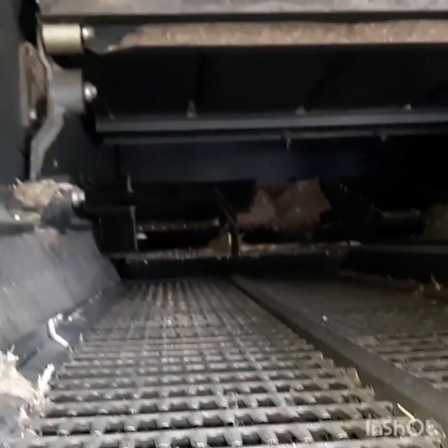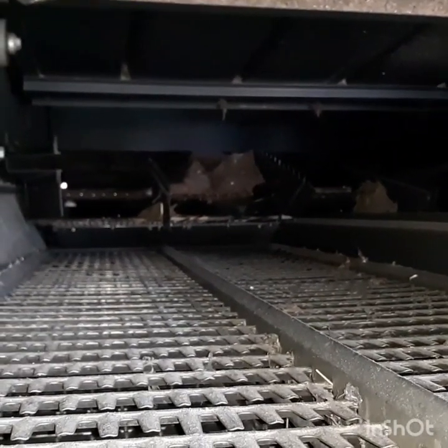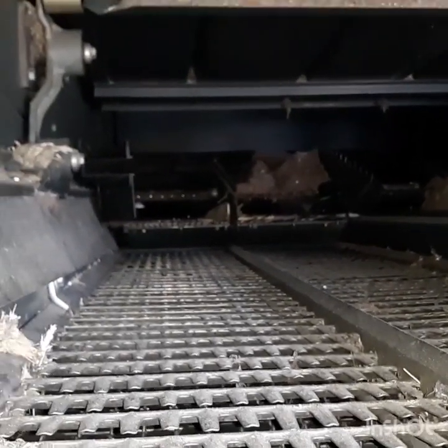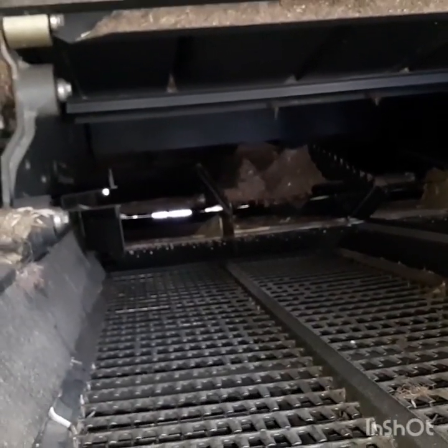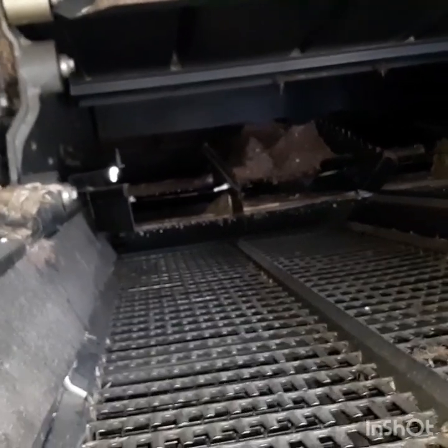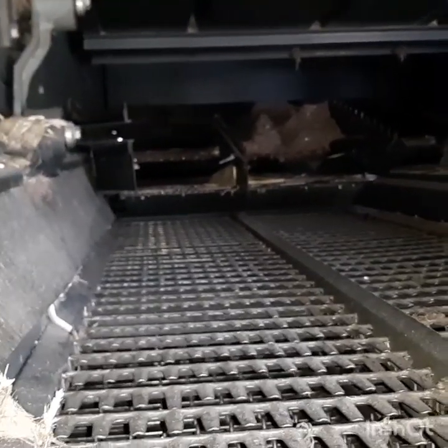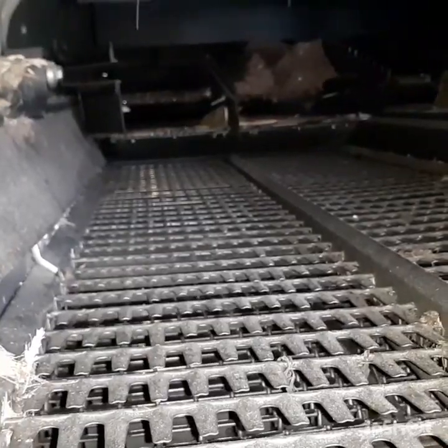Around the back of the combine, obviously you've got your chaff spreader, your cleaning shoe, and above us is our grain pan. Any grain coming off the rotor slides down that pan and goes to the front. You can see the amount of chaff — that's chaff I knocked down while I was in the grain tank digging around the rotors. You can see those air gaps right below, that light — that's where air is coming through. As that grain cascades from the top to the middle to the bottom level, it keeps getting blasted with air, so by the time the grain gets to our shoe, there's very little chaff left.